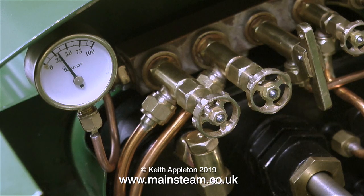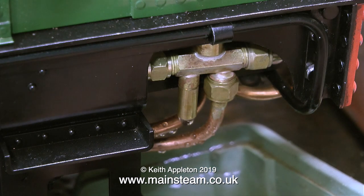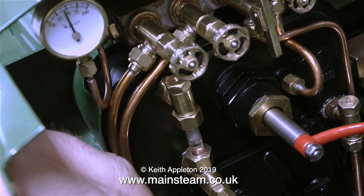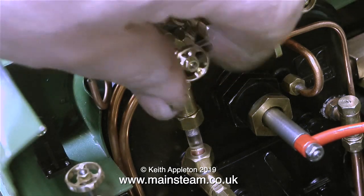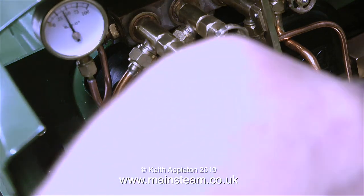The injector knocked off with a big cloud of steam because the water went right to the top — if you get water coming down the steam line to the injector, it will not work at all. By now we have a bit more pressure, going up towards 40 pounds per square inch. Water valve on, let the water run, open the steam valve and the injector injects immediately, pumping water into the boiler. Sometimes you get it right the first time; other times the water continues to run and you just have to back off the water a little bit, then it picks up and makes that lovely sound as water is being pumped into the boiler.